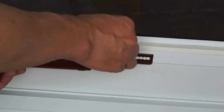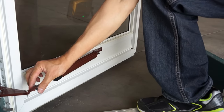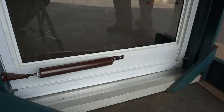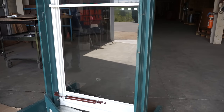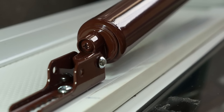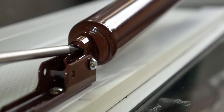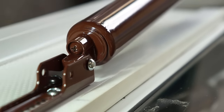With the installation done, let's test the door closer. Open the door and release the washer — remember, we had it pre-tensioned. If your door closer includes a spring-loaded speed release washer, it will release itself automatically when you open the door. Let your door close; it should shut smoothly and securely. If your door doesn't close, or the speed is too fast or too slow, you can adjust the tension on the door closer. There's a tension screw at the front end of the door closer. Turn the screw counterclockwise to have the door close faster or harder; turn it clockwise to have it close more slowly.